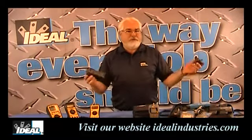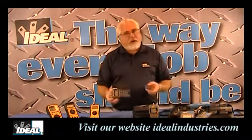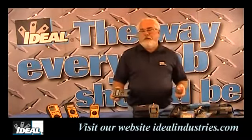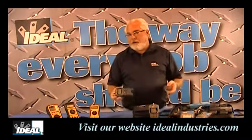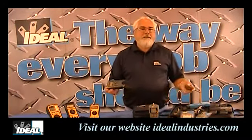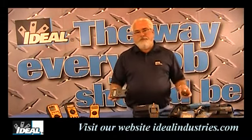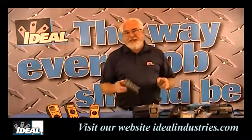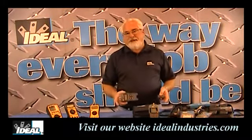That might be in another room, or if it's just a patch cord, it could be just a couple feet long. This tester does all the basic tests you're looking for. For coax, it looks for opens and shorts. It will also look for USOC wiring in phone circuits. For data networking, it checks for 568A or 568B wiring schemes, and looks for opens, shorts, missed wires, reversals, and split pairs. The tester also does length and blinks a hub — so it's a great little tester.